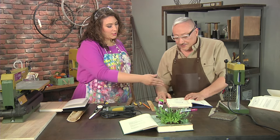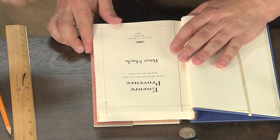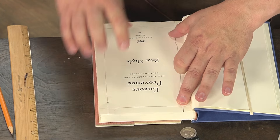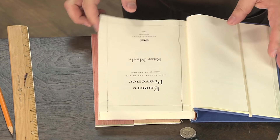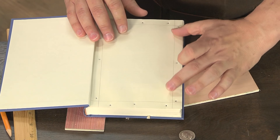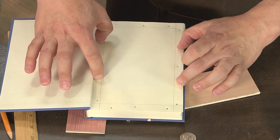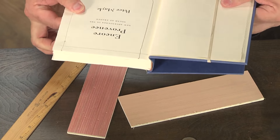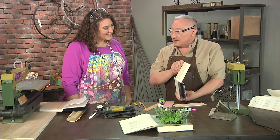So how many do you put in on each side? I tend to do four on either side here, and three here and here, because we're going to do the exact same thing on the back. If I do three on the back, I know I'm between my four — I'm not nailing it to the same place. When you're done, you're going to have this whole thing bound as one solid block with the nails around both sides.